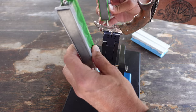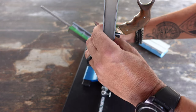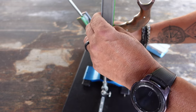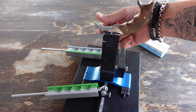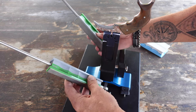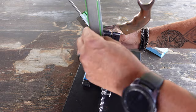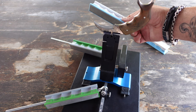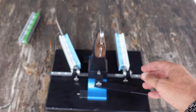I'm ready to get started, going to start out with the 1500 grit stone. Keep in mind that Wicked Edge does recommend that the stroke should be down and away. I like starting out with my stones nice and high, gripping towards the back, keeping my fingers out of the way, and then nice simple easy strokes going down and away. Feeling pretty good — starting to get that razor edge. Switching over to the 2200. At this point it's pretty much good to go, but since I have the 3000 stones here I'll give a couple passes with them. And I think we are good to go.